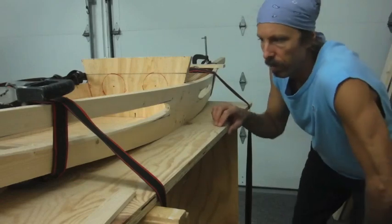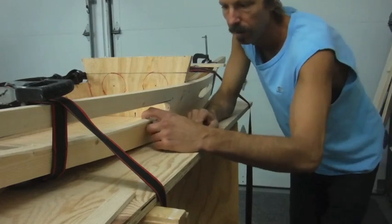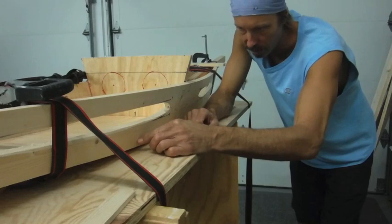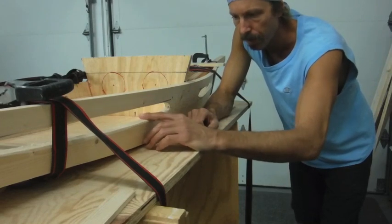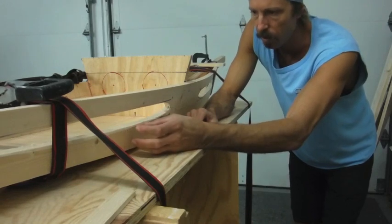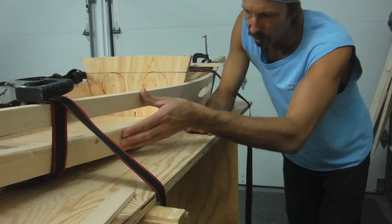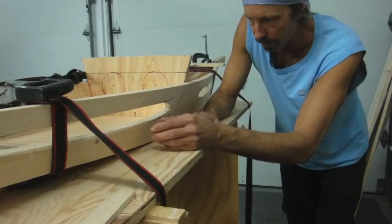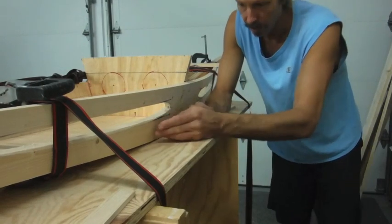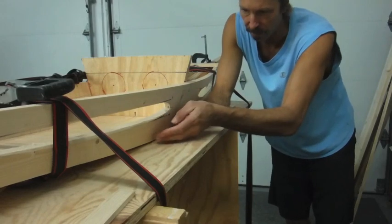The reason I went with this side piece as solid wood was that I could have some kind of give when I screw through it. It can push in a little bit — there's more meat to deal with. And when I sand it as well, you could potentially use a thin high-quality plywood for this same piece right here, but you wouldn't have as much tolerance. That thinner plywood would give you more of a sharper edge because you wouldn't have as much wood to work with.